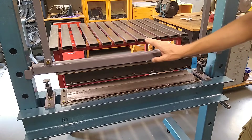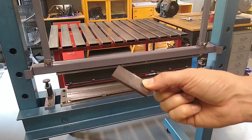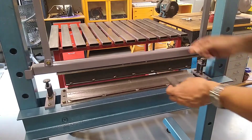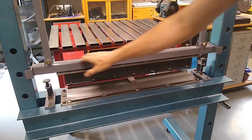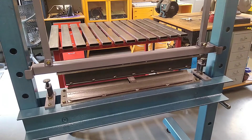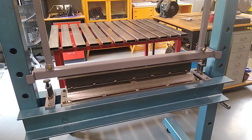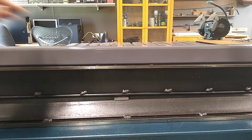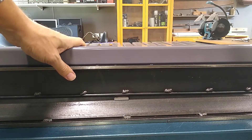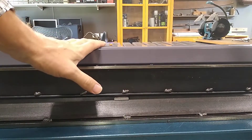Now that it's painted, I haven't tried this on any thicker metals. So I thought I might try with a bit of 5mm thick flat — I think this is 32 by 5mm. I'll just pump this in here and give it a go, see whether we get any deflection. Okay, that's just a tiny bit of deflection there — less than a mil. That's not too bad. I was actually hoping for zero deflection, but I didn't make this to be bending flat bar — I really made this for bending sheet metal.